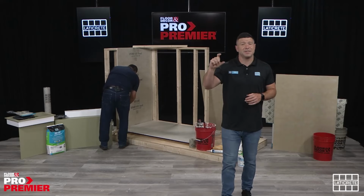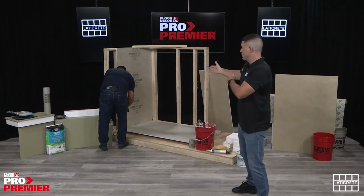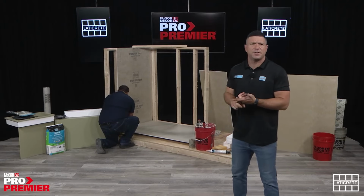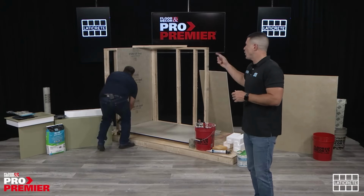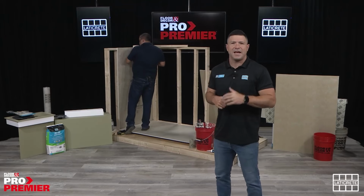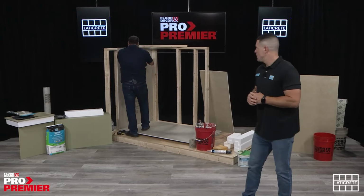So the dots on there not only help with the modification of the board should you need to cut it down, which we did for this installation. We cut down the bottom so it would fit on the rabbet joint. Very easy to cut with a utility knife or a circular saw. Scores extremely easy. Every 12 inches we're going to be putting a screw. So if you think about it, it's every 3 or 4 of those guide markers or those dots. So they act as guides for the nails, and they also act as guides for cutting.